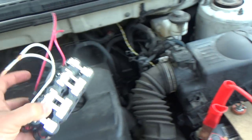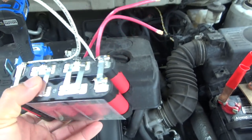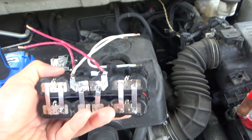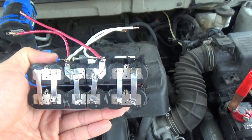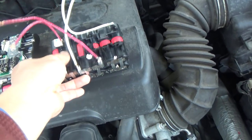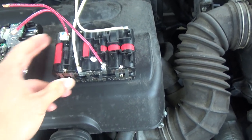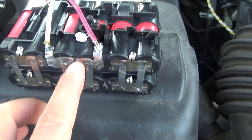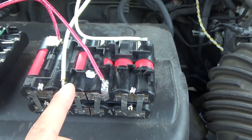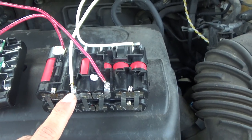What I did is I made a battery pack that is 12 volts. This is a 3S4P battery pack, made from two of these. I cut right in the middle, so they are in series but I cut in the middle so only three in series now. That's the positive terminal, that's the negative terminal, same on this side.